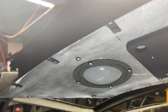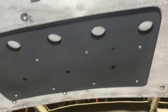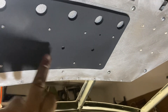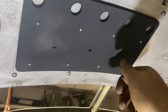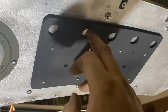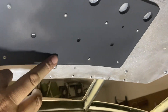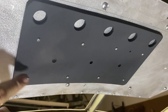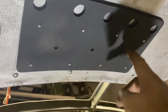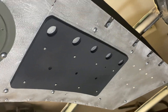That's my theory. I made the lighting panel today — 3/16-inch plexiglass. It's got provisions for your fuses, and then you've got your potentiometers with your knobs for your floods, your whites, and your reds. So I think it's floods, reds, whites, and two spare fuses — or vice versa. These are the screw locations. If this were a real lighting panel, it would have half-inch holes because the bulb holders bolt up there. I don't have those — they're five bucks a piece and that would be forty dollars — so I'm just going to make resin copies with screws embedded in them.